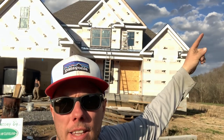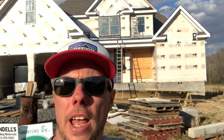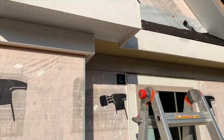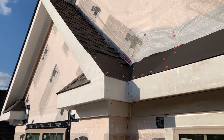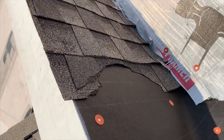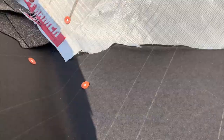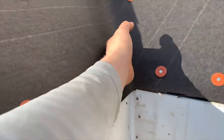Alright guys, it's the next day. I got that piece up there fixed and got it all felted in. Let's run up the ladder and I'll give you a close-up look at the finished product. Check that out — got it all felted in, tied it in under those shingles right there. It's supposed to rain tomorrow and didn't want to get all that plywood wet and run water behind the window. Pretty sweet — got my felt running up behind the flashing. We'll get the roofers over here, tear the rest of these shingles off all the way up to the top, start down here, get them to run their starters, and lace it in on this valley. The plywood came over and rested on that thing so perfect.